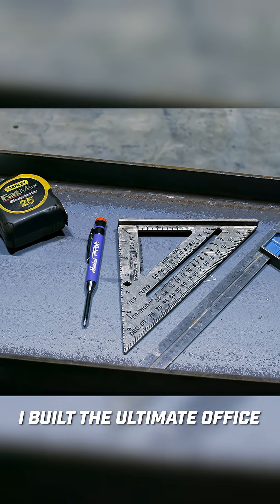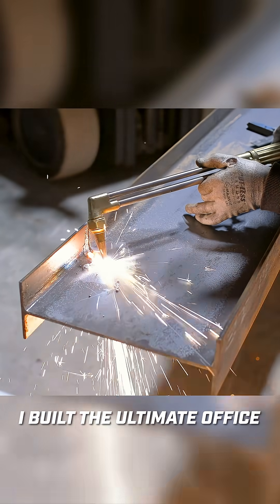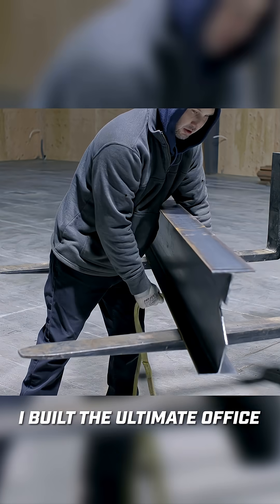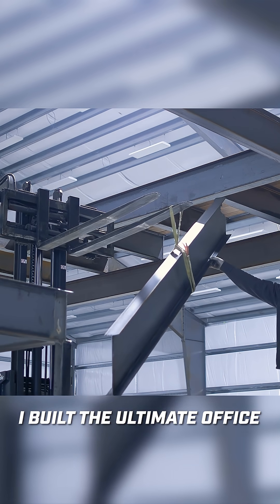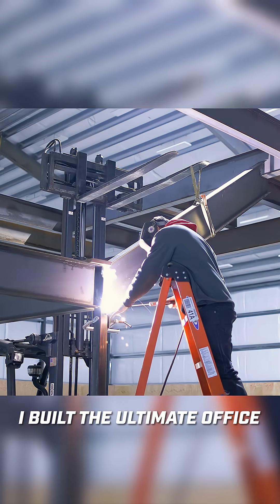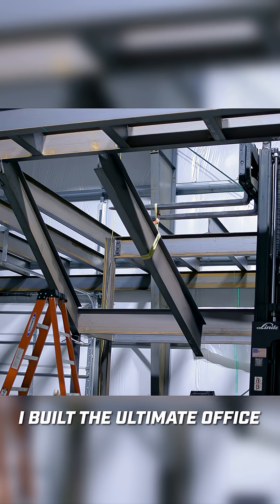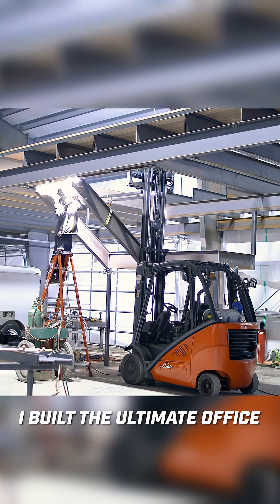The next step is to install and manufacture this upper stair horse. It's going to be by far the most challenging, not only in the fabrication and layout, but the installation also. For one, I'm by myself. So in order to accomplish this, I attach a choker to the midpoint of this beam. This is going to allow me flexibility and control and be able to pivot the beam when I go to install it. It also helps by getting it in between two pieces that could get wedged.